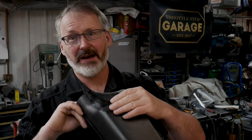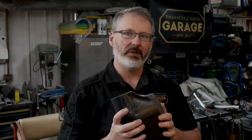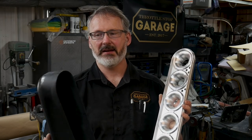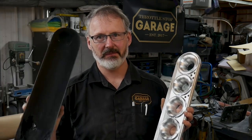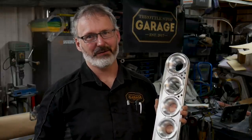After many hours of sanding — which I did not record, so sorry — I'm happy with how everything has turned out. There were a few flaws, a few mistakes, and we still have a little ways to go. I still have to finish sanding the areas between the joints of the two parts. There's a really nice big lap joint in here, probably 40 millimeters wide, so that should be plenty of glue area. It's good and stiff. The backside was a little bit thick — I did add nine layers of carbon fiber total to that back edge, so I overdid it just a little bit there.